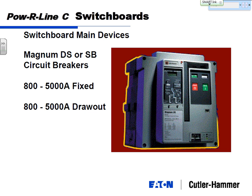There are just different, more rigorous testing standards than for a molded case breaker like this. And these testing standards make the breakers much bigger. You know, you're talking 18 inches, 24 inches high by a foot wide. Why one of these would be beneficial is that an insulated case or an air power circuit breaker allows you to have electrical operation. The opening and closing of a molded case breaker has to be done with this operating handle on the front. And even at 2,500 amps, because those springs in here are so tight, you need an extension arm on the front of that breaker to open and close it.